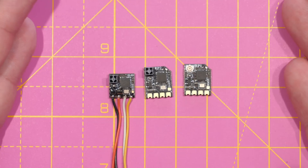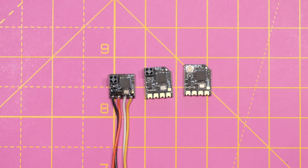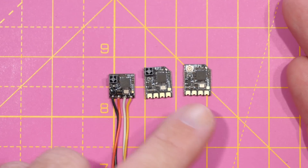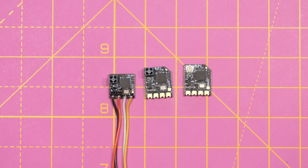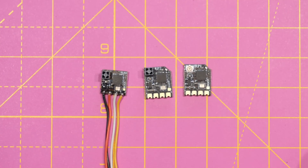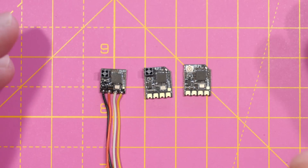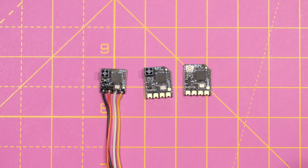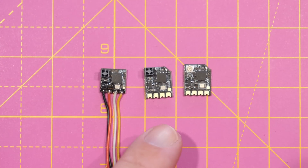You can see that they are larger overall. Radiomaster states dimensions of 13mm by 11mm by 7mm for the model with the built-in antenna. Weight-wise, you're getting about half a gram for the RP2 with that built-in tower antenna and about 2.2 grams for the RP1 with the external antenna. All three support the same ExpressLRS features — they're all 2.4GHz, they all support 500Hz or F1000, and they all support CRSF input.